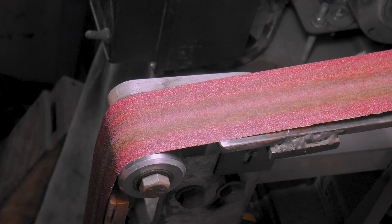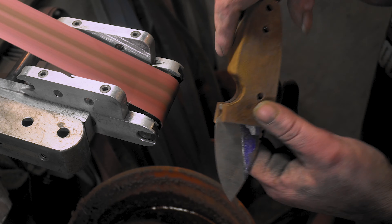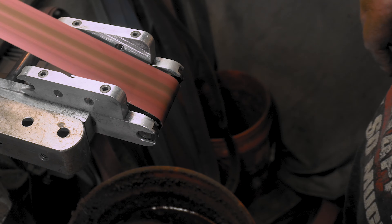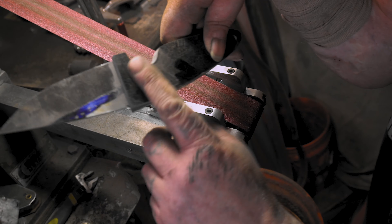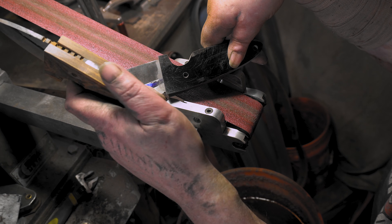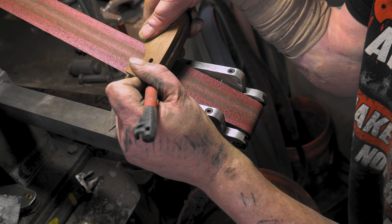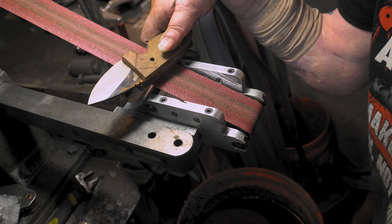All right, small wheel attachment time. I'm going to take these off — I noticed right here there's a gap, so I'm going to hit this on my disc grinder until I get that down. On this one I want to come from about here, and cut it something like that. So I take these off, put them together, and then cut it. Anytime you're taking these pivots out, go to the hardware store — Home Depot, whatever — and make sure you buy the right size screws. These are 8-32s.